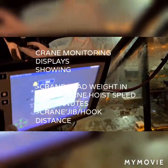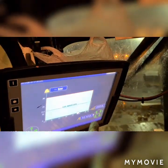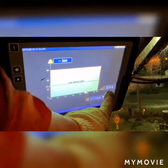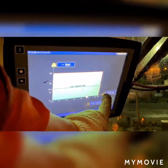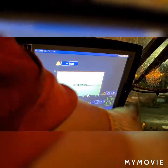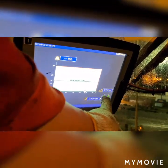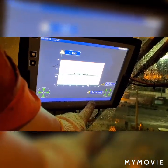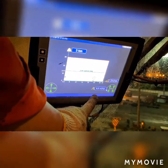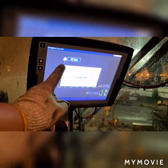What you can see here is our crane monitors. The yellow indication means a good and healthy weight. This shows the length of our hoisting reach from the crane jib — I have 20.8 meters. There are encoders down there, and those encoders indicate clockwise or counterclockwise rotation of the hoisting up and down winches. Rotating clockwise indicates positive values. The top-left yellow indication means a good weight; if it turns red, your crane is overloaded.